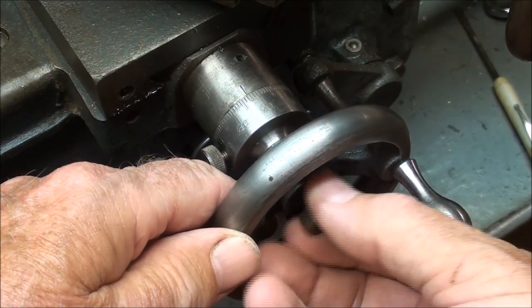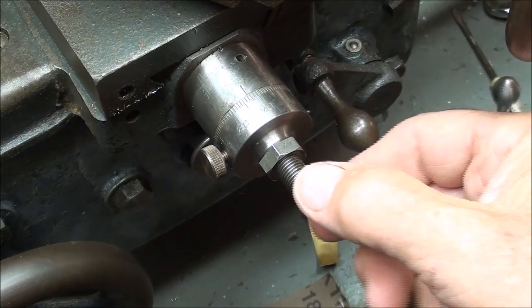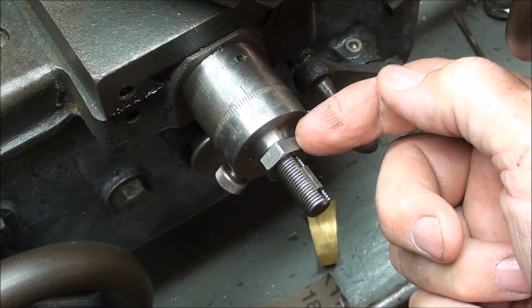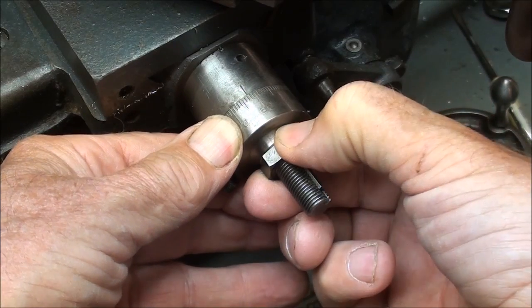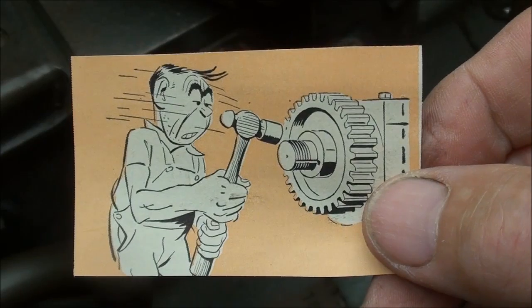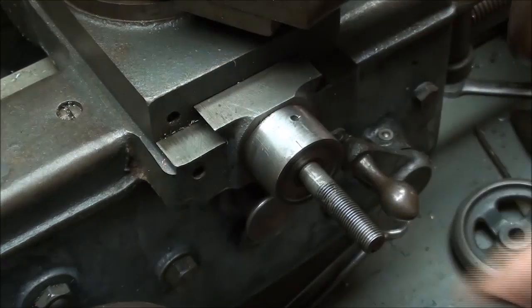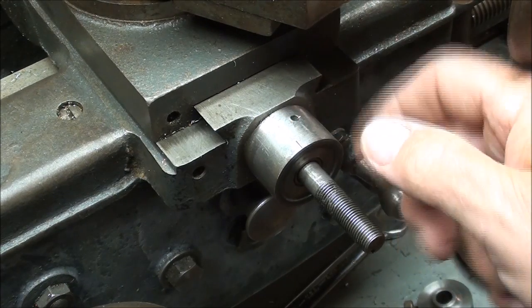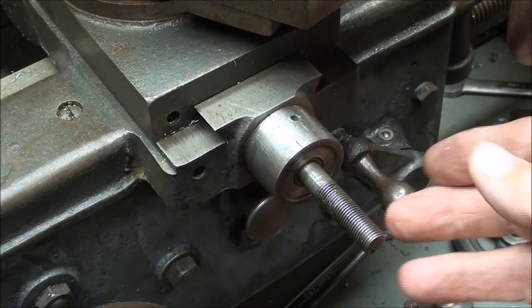To start with, I've already loosened the nut here, and it allows me to pull off the hand wheel. Then there's a little key here, and another nut, and then this dial will come right off. I'm going to do that off camera because this is a little bit hard to get off — the thread is buggered up a little bit, because at some point a hammer-and-chisel mechanic had at it. Now the collar will come right off the dial. I don't really need it off; I just want to show you how this is made and give you an alternative way of doing this job.